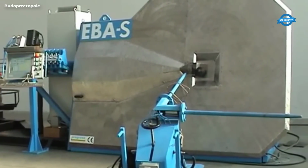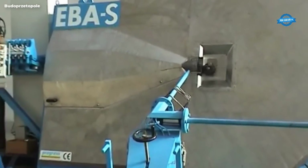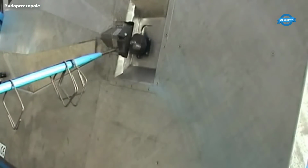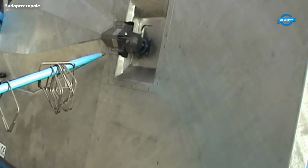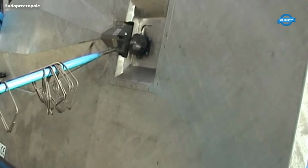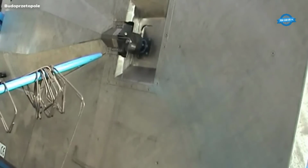The EBAS automatic stirrup production machine processes wire coils in the 6.5 to 16 mm diameter range. This compact, efficient machine is designed for robust operation, combining ease of use with high output and accuracy. The integral control system ensures precision and fast production. In its fully automatic version, the machine features program-controlled coil settings and an optional automatic wire diameter change for seamless adjustments.